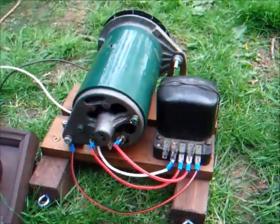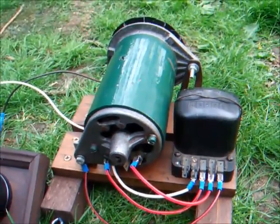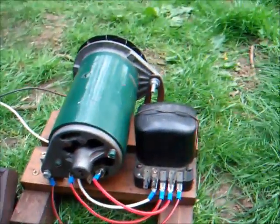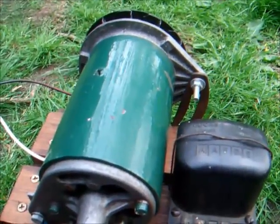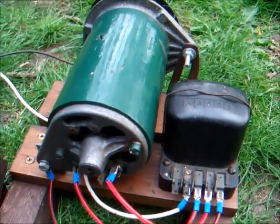So hopefully that helps. I don't need a battery to give it a kickstarting jolt to get it generating. I usually just have to give the engine a little rev after connecting it up and belting it to the engine — usually just a quick sharp rev and the Dynamo usually starts generating on its own. I've never actually had to connect a battery to it to get it to generate power.